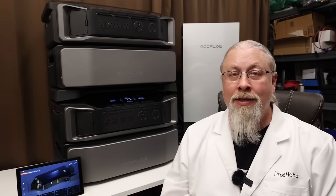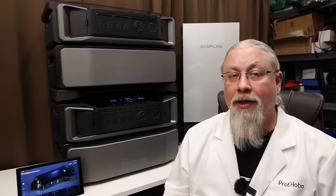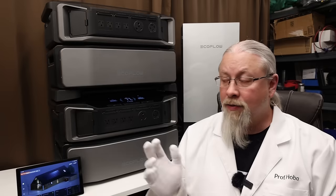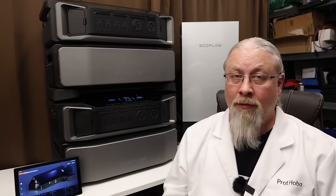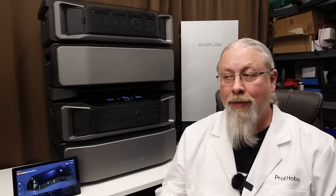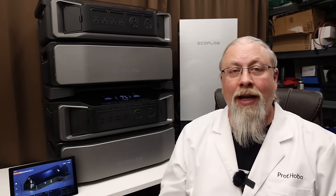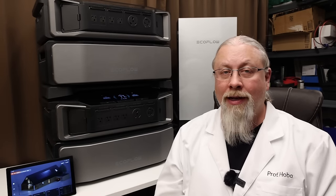The biggest pain point is going to be if you plan on having your Delta Pro Ultra — or DPU, which I'll call it from this point forward — in the same location as the Home Panel or in a different location. My installation difficulty I'm going to consider moderate since I will be requiring 240-volt service, and instead of replacing my existing breaker panel — which is basically full of spaghetti wiring and stuck between wall studs too narrow to fit this new home panel — I'll be installing it alongside my current breaker box.